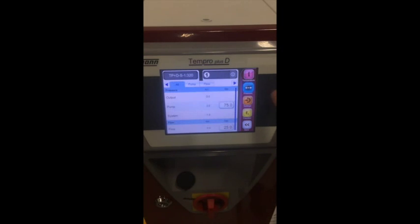Now we will head back and get to the pressure and flow section, which is responsible for the actual value and setting monitor desired value and tolerance values. This device is equipped with two pressure sensors and one flow measurement path; however, keep in mind your unit may have more or less depending on your device. This first tab gives us an overview of the actual and desired values for pressure and flow for each circuit. The input pressure is measured at the pump outlet and is the highest pressure achieved in this mold circuit. The pump pressure is the difference between the input pressure and the system pressure — this shows the value by which the pump really increases the pressure. The system pressure is the pressure before the pump, adjusted to the relevant temperature to keep this value always slightly above the boundary between water and vapor. And lastly, the flow is determined using measurement methods in accordance with the temperature.